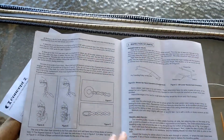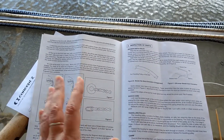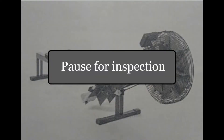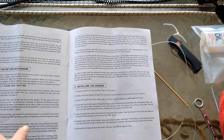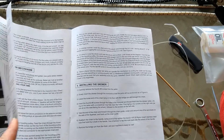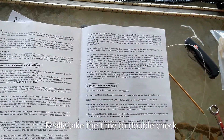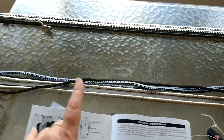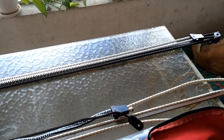We're going to inspect everything, but we're not going to change out individual parts — I just decided to go whole hog and change out the whole thing. I've inspected everything according to the book; the last instructions say make sure that it looks like the diagram on this page, Figure A, and it does. I pulled the chain out to make sure the mechanism — the traveling pulley — pulled like it was supposed to, and now we're up to installation.